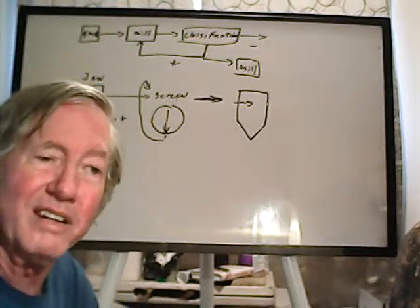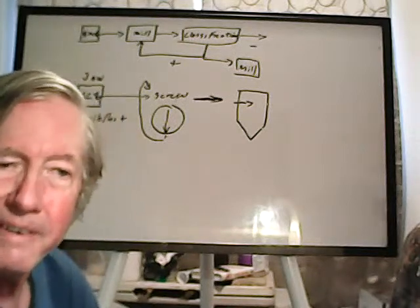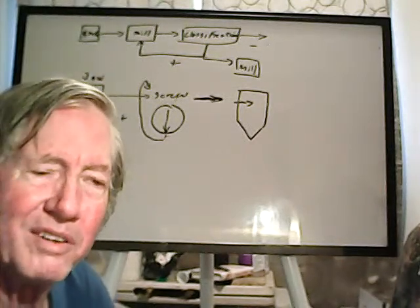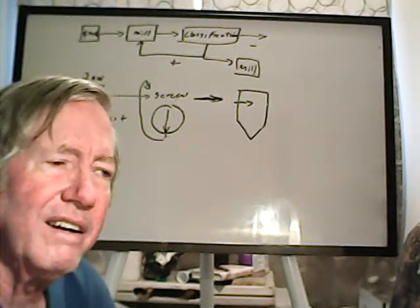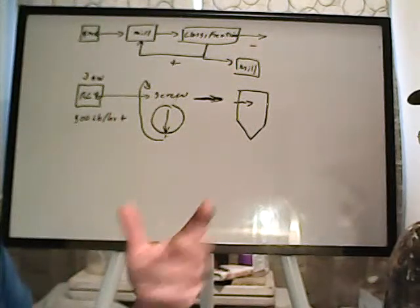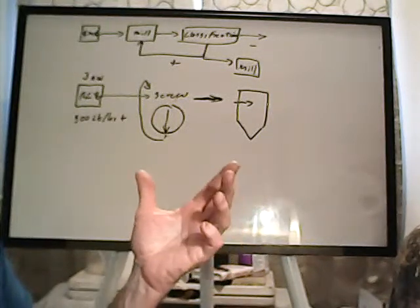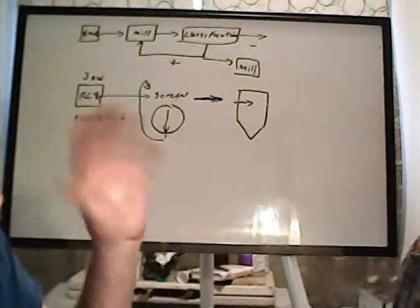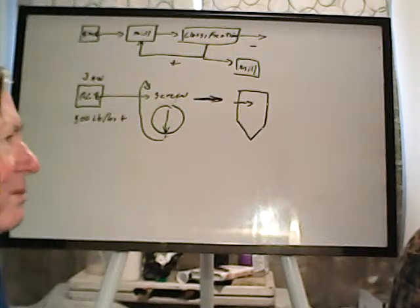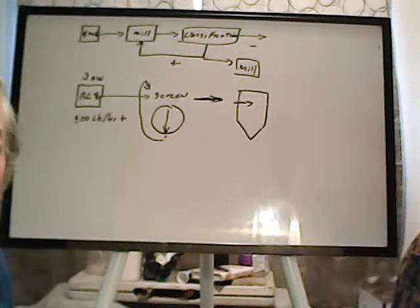Chris, I did the same sizes: 30 plus, 35 plus, 60 to 35, and 60 mesh minus. I got 3 different samples off. I think that was raw bead, but you'll have to see what Lauren tells you. The assays showed that the finer size material is running about 0.12, one was 0.16, and the 35 plus was running 0.23 or something like that. Our head grade should have been somewhere between 1/2 ounce and 3/4 of an ounce per ton. So it should be a reasonably good recovery, but it's not finished. All that's still on the leach pad, still leaching. Come spring, we should get more out of it.